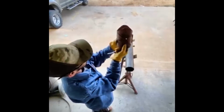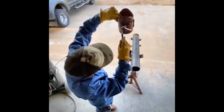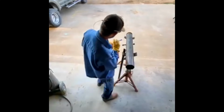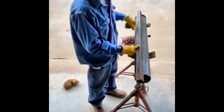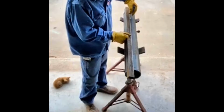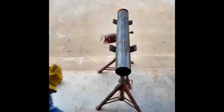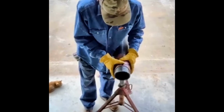This one is just a regular old saddle. It has your 45 or your 90, so you can do 90s, your 45, and then your saddle. Usually if I'm doing a whole bunch of these, like we were doing at the house that day, you're finding a generic piece of angle iron. If you're building one that's gonna have saddles on both sides, you can use an angle iron to make your line down it so that you know your saddles are gonna come out the same.